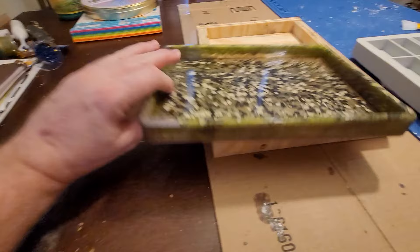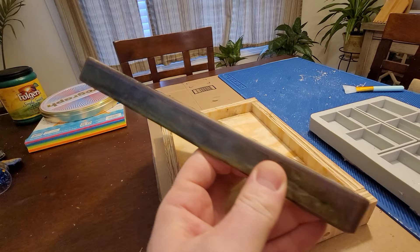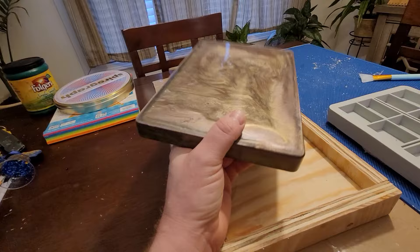What I noticed about the bottom is that it doesn't set up high enough. So what I ended up doing was I chamfered the edges all the way around at 45 degrees with the table saw — you can kind of see that on the edge — and then went back in and repoured. It's kind of hard to get these flat. I wish I had a drum sander, because I've got a planer but you can't really do epoxy on planers.